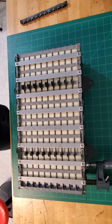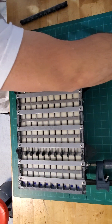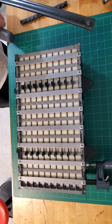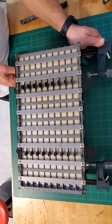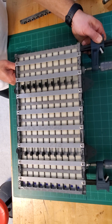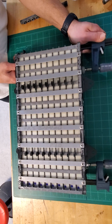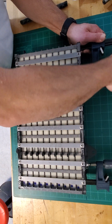You need to make sure you clamp that side of the batteries. Use extreme caution — all your little studs for your battery terminals are exposed right now, so don't touch them with the metal clamping device or whatever you're going to be using.